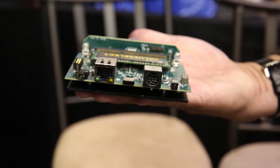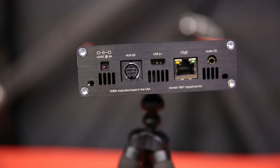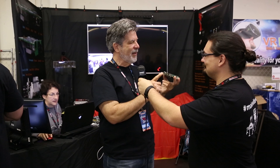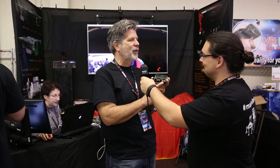The backside's always beautiful. On the backside of the camera, we've got a four-pole audio jack that allows headsets — stereo out, audio in. There's a GigE for Ethernet, so you get long distance up to 100 meters, then you can put an amplifier on it. USB 3C, so it's either direction — no up or down. Auxiliary I/O gives you access to sync, strobe, power, and debug functions embedded on the board. And if you need more power than you can draw off USB, we've got a 5-volt input.